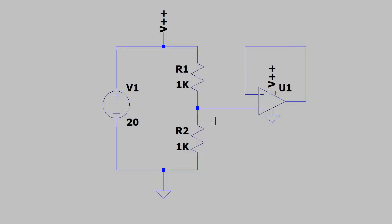The problem with this voltage divider is that if you connect any kind of load to this virtual ground — which we're using as a virtual ground for all the op-amps — the voltage divider is no longer dependent only on these two resistors. Instead it depends on these two resistors plus whatever load the circuit adds, which can be modeled as an additional resistor in parallel with R2.